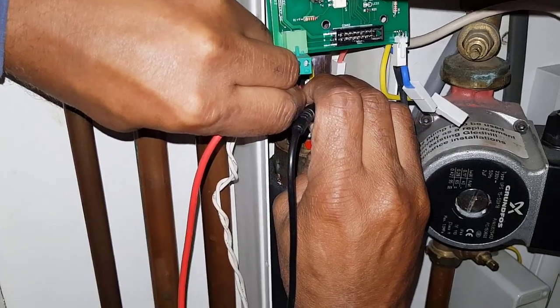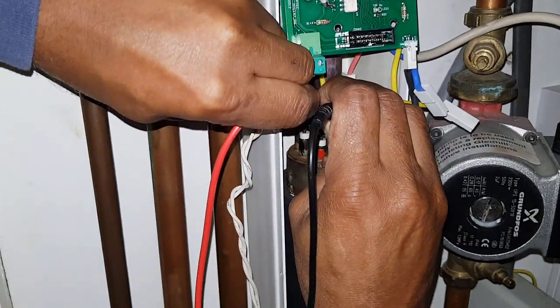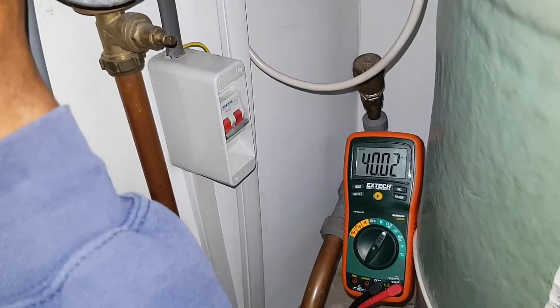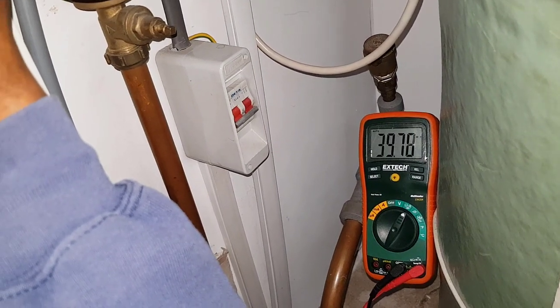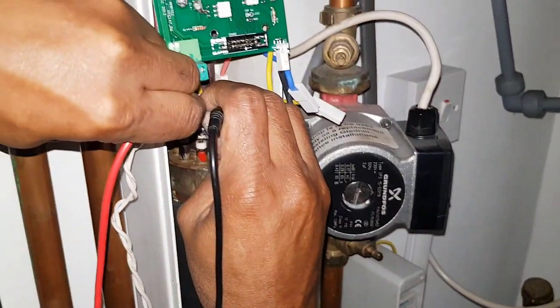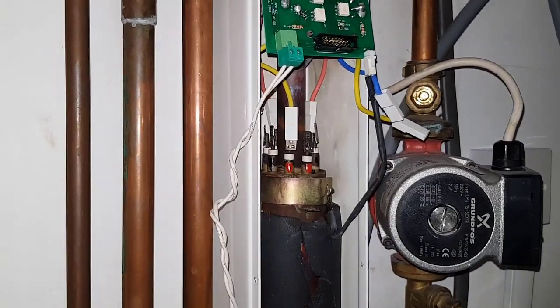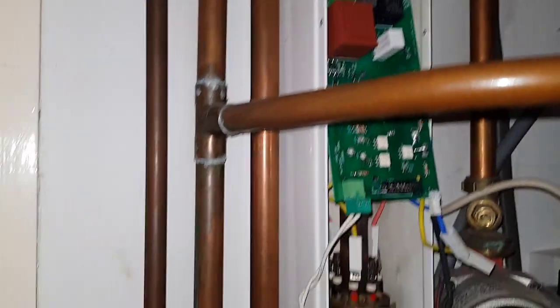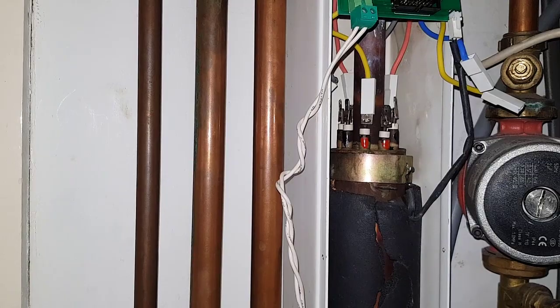Now on the pinks — looking at the multimeter, the reading is out of range at 39. So there are definite problems with this heating element. My conclusion about this flow boiler is that it needs replacing. We definitely have a problem with this heating element.